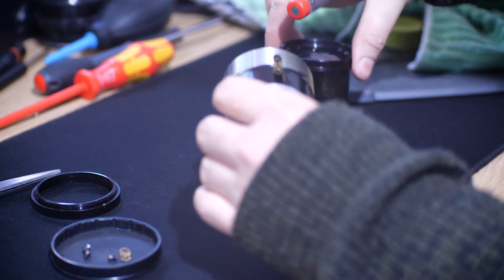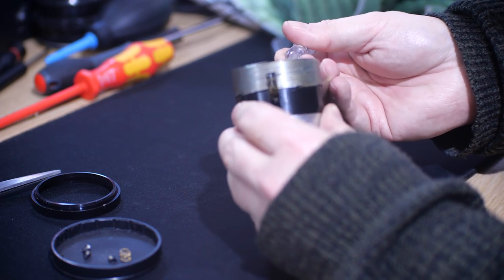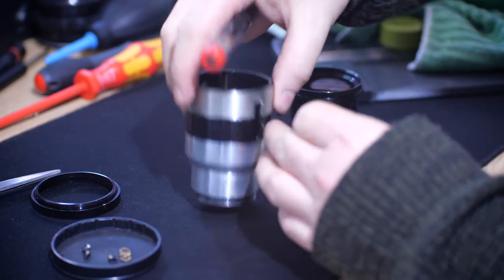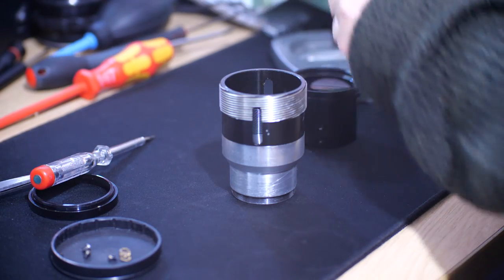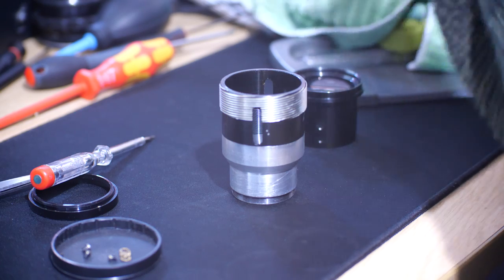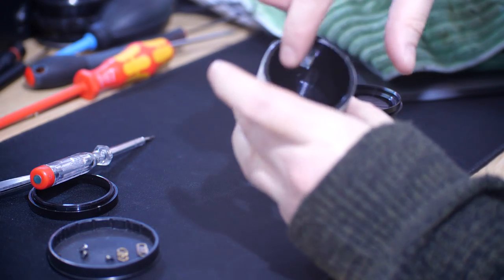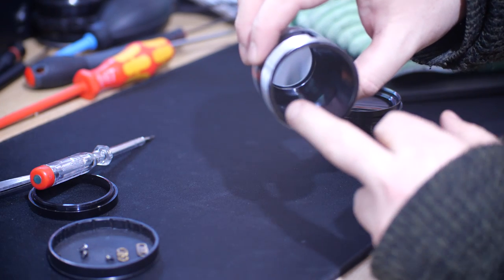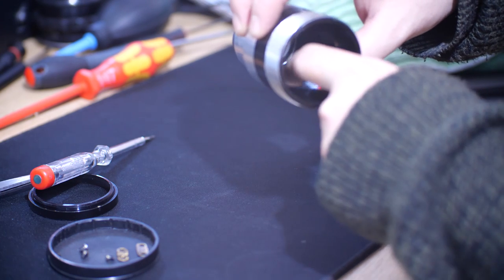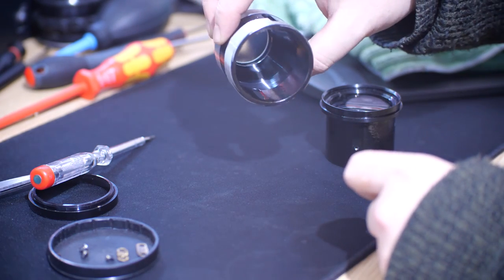I can just pull this out and then tap it out. At the top end, it grips a bit more if you slide it down and push it out slightly. This is all gunked up. For the inside focus to move smoothly, you've got grease all around this and it presses against all the inside here as well. All the initial part in here is greased - there's kind of a more grooved shape inside and it's normally greased up to that point but not beyond.